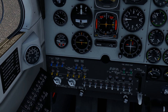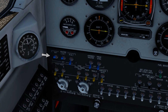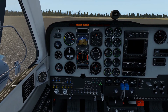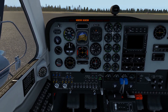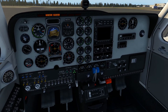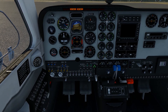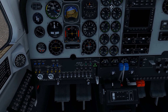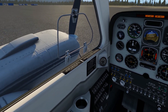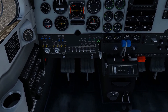Now we will start by turning on the battery — it's down here. We turn on L alt and R alt. We already hear a small sound and we shouldn't take too much time, because the plane is only running on its own battery now. If we leave this on too long, the battery could go empty, so we should try to start the engines as fast as possible.